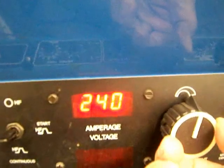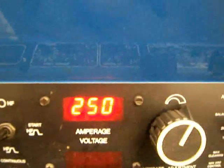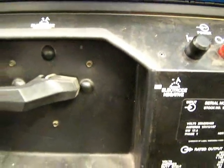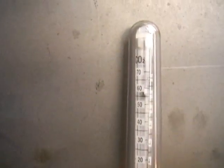I'm starting out really high. You can do some pretty decent TIG cutting with a lot less amps than what I'm using here, but I'm going to jack this all the way up to 250 amps first. I'm going to try cutting some 11 gauge aluminum and then go down thinner from there. You can cut really thin metal with maybe a hundred amps or so — you don't need 250 — but I'm swinging the pendulum way far today. DC EN — electrode negative.